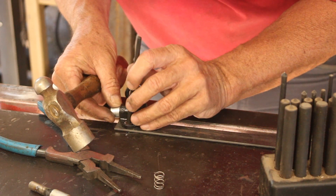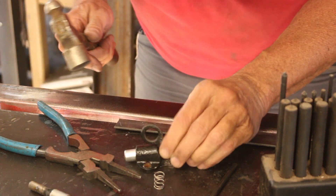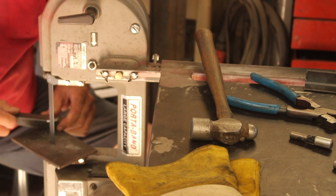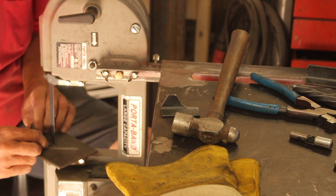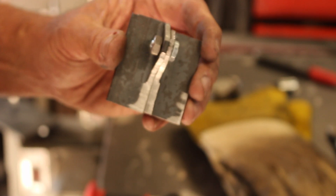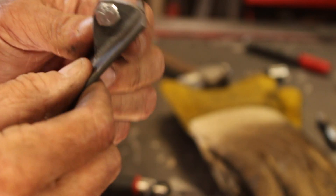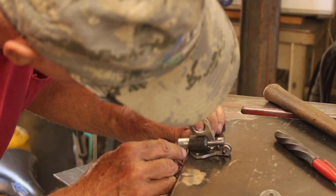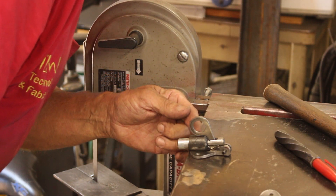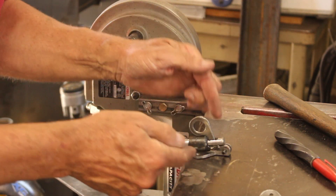The way I'm going to do this is transfer that image of that shape and then cut that out. Here I've got my two rough-cut pieces — to make them symmetrical I've bolted them together and will now grind them to the same contour. There they are contoured to match each other. Now we need to fit them to the cylinder. There it is all fit together. I've got this held together with a roll pin and it is working just the way it should. Now I'm going to come in and lay a little weld in there with the MIG welder, weld the underside to stick it all together, then take it back apart and put the spring in.